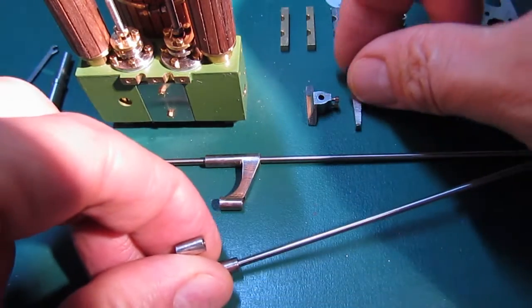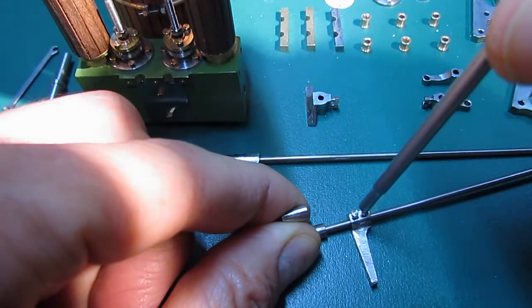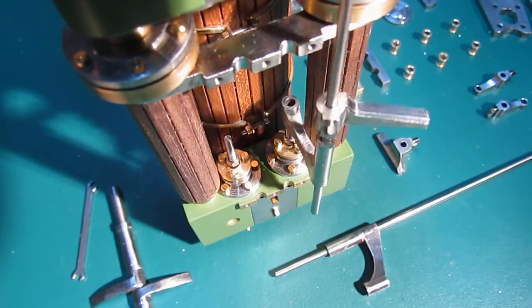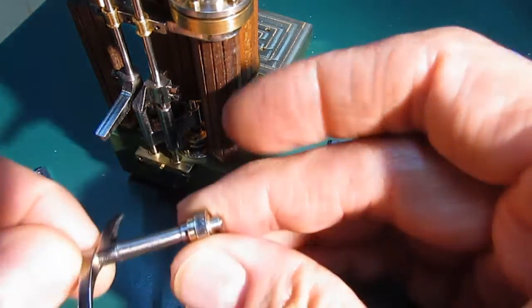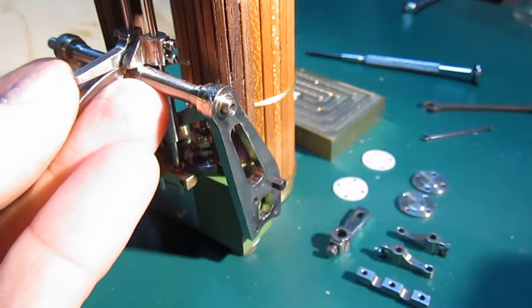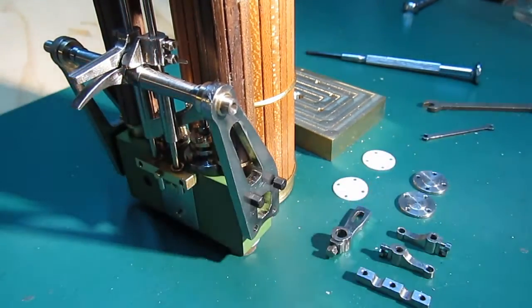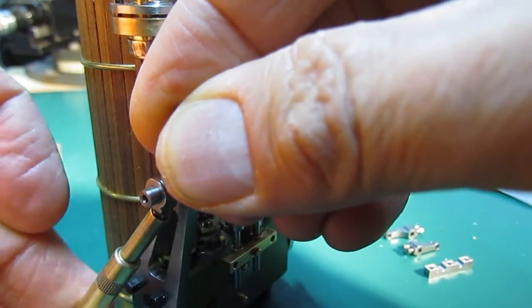Here I'm installing the actuating mechanism. That's the lifter with one of the toes. It's the crossover lifter — it only came with early engines with the single set of wipers. And here, the rock shaft with those wipers. To control the wipers, an eccentric fixed on the crankshaft will have its rod coming along this side and hook on this lever.